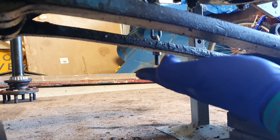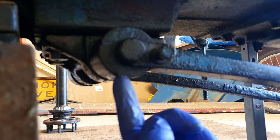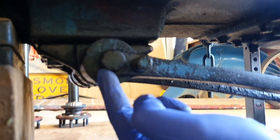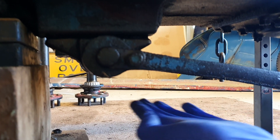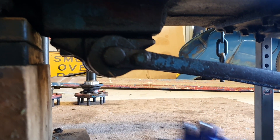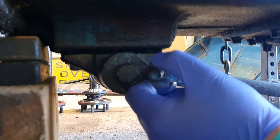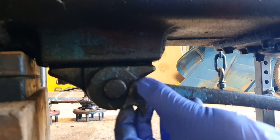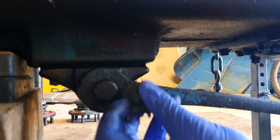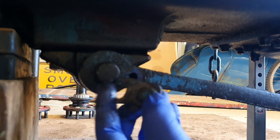To enable the drawbar to go up and down on that adjustment plate at the rear, you've got this pin going through. Removing this pin will allow you to drop this off without having to unbolt the mounting plate — depending what application you've got on your tractor. I pre-loosen this; it's just to lock into the rod so it doesn't fall out.